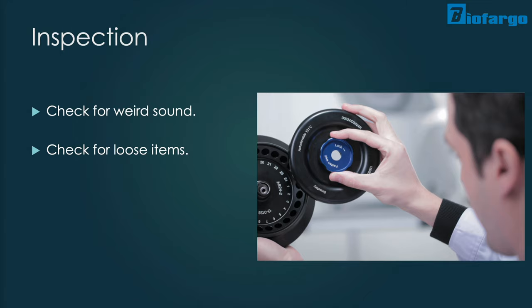If everything is perfectly balanced, check for small items that might have been left in the rotor, such as loose caps, spills, and broken tubes. Another easy thing to spot during your inspection is corrosion, which usually comes in gray or brown color and can indicate a much bigger issue than it seems. If you spot corrosion on your rotor and leave it unattended, it will eventually lead to cracking of the surface and will break during high-G-force centrifuge procedures, not only damaging the machine but potentially the users as well. If you're still not 100% sure on the issue, then it is time to call for a professional to inspect your machine for damage to the interior parts.